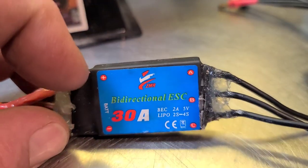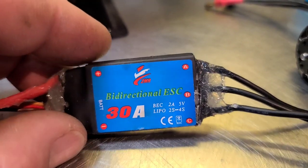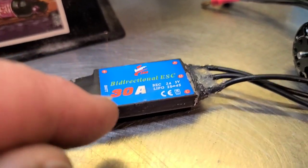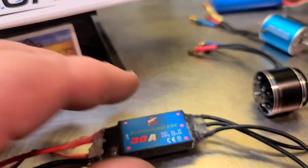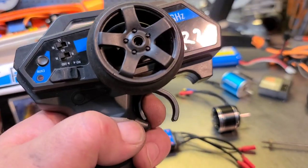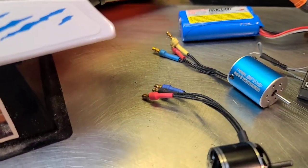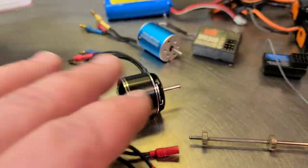I'm going to be using this 30-amp bidirectional ESC. This is a $10 ESC and they're great — they actually got a lot more power than I originally thought they would. The reason I'm using this ESC, opposed to a Dynamite 30 or something like that, is one, it's lightweight, and two, it's bidirectional. With this ESC, when you go forward it goes straight into reverse. So we shouldn't lose our self-righting feature with this speed control. You can use any speed control you want — a little 20-amp would probably be sufficient for a small motor like this.